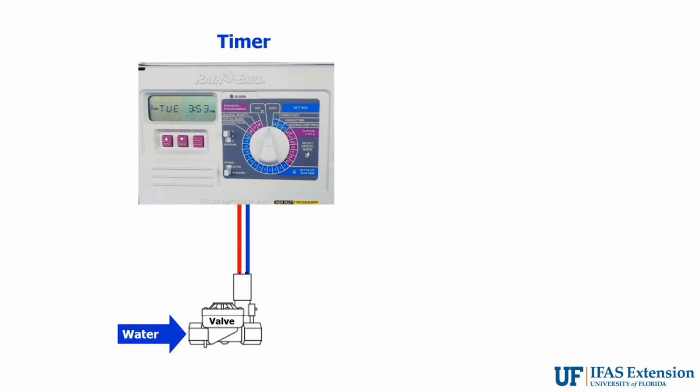First, let's review the basic setting of an automatic irrigation system, where a timer controls the irrigation. Each irrigation zone has a specific solenoid valve. The timer is connected to each solenoid valve through a hot wire, and all the solenoid valves are connected together through the common wire. So, when it's time to start a scheduled irrigation cycle, the timer sends a signal to the first valve through these two wires. Then the valve is opened and the water flows to the specific zone.